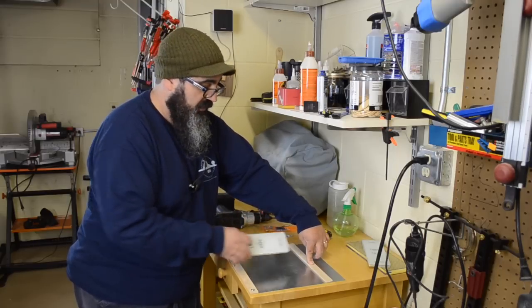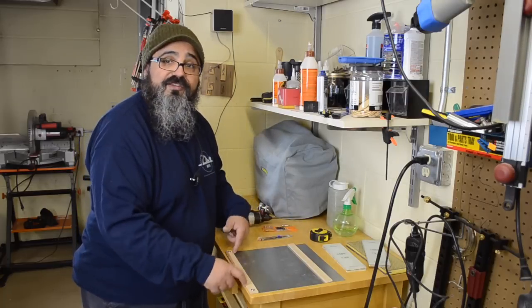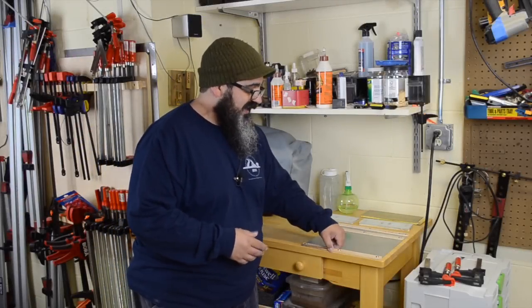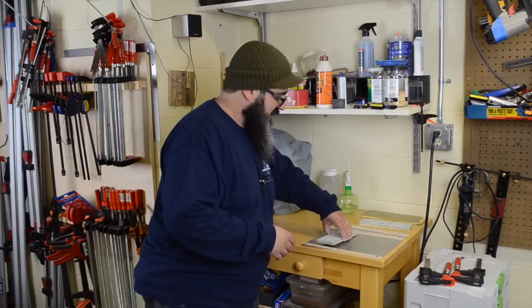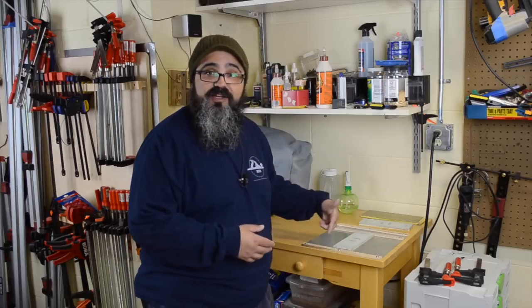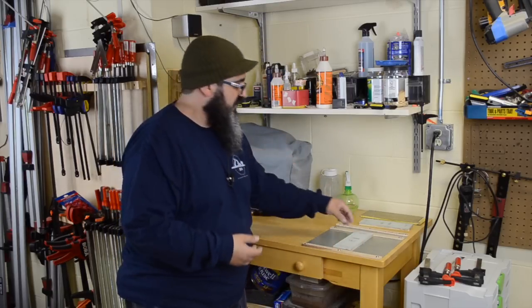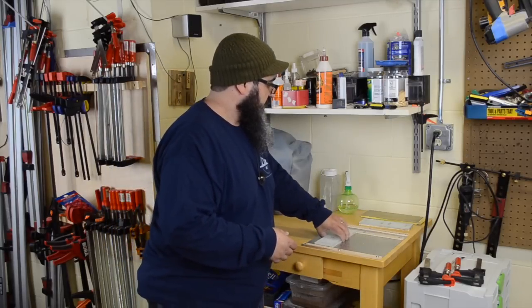Attaching the plate itself was really simple, and adding these bumper strips is even easier. We did have a little design change on the fly — as I was looking at this more, I was concerned that if the stone is centered and I'm applying pressure, the thin strips might flex slightly. So I went ahead and added another set of screws, one at the top and one at the bottom, to ensure there's no major flexing or potential breaking of those strips.